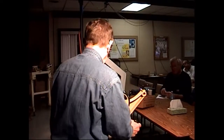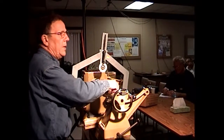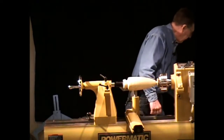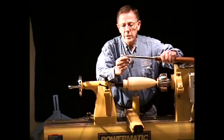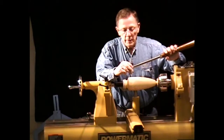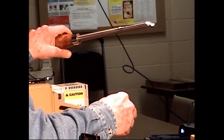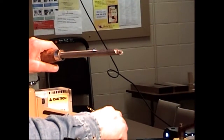Now the plastic, I can go up and support this, whether it's raw wood or a finished piece like that, it'll work just as well. I didn't talk about my philosophy about gouges, for example. I use a Wolverine system, and I know there are people like Mike Mahoney and some other folks who buy their gouges by the dozen or the gross, and they go through them real fast because they turn a little, hand grind, turn, hand grind, turn, hand grind.